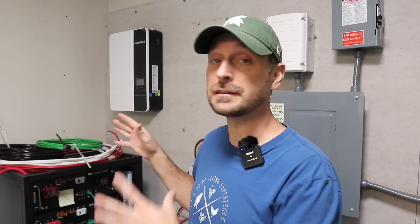Before you ask why we're taking out the old system — the GrowWatt 5000ES — I love these. There's no change in my opinion of them. They are great, but we are going to be using them for our barn and our well, which are about a hundred yards away from our house on a completely separate transformer still connected to the grid. So instead of running 400 feet of wire from the main house up to the barn, I'm going to put in a separate system for the barn, and of course it's going to be much smaller.